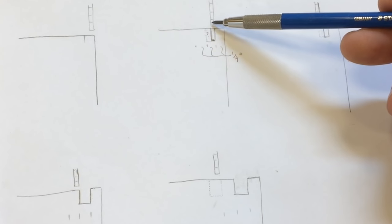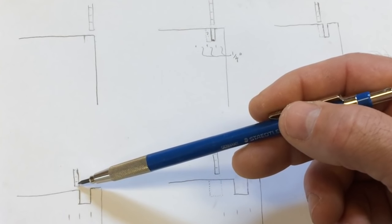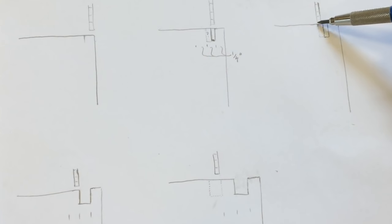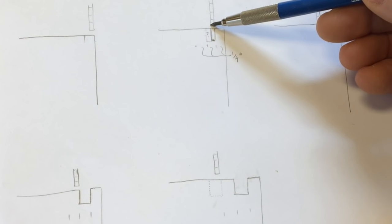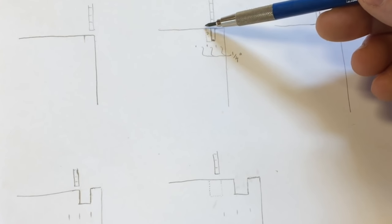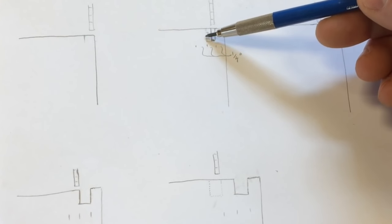You don't want to move a full quarter inch because that's going to bring you over to this point right here — that's where you'll be when you move a full turn. We need to figure out where to put the blade to line its left edge up with this line, which is what that piece of tape represents. One way: make this cut, take a caliper, measure over a quarter inch, and line it up. Another way: make this cut, line the left edge of the blade with that point, then move a quarter inch using the jig to give you that dimension, and you've got the left side of your slot defined.